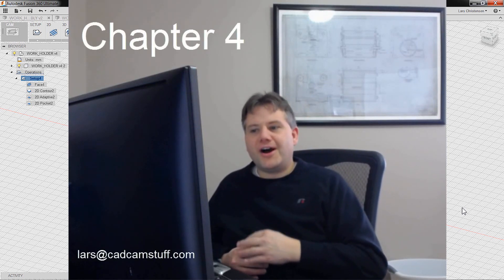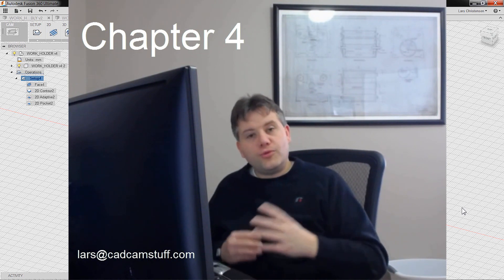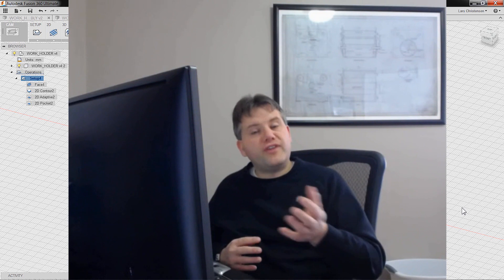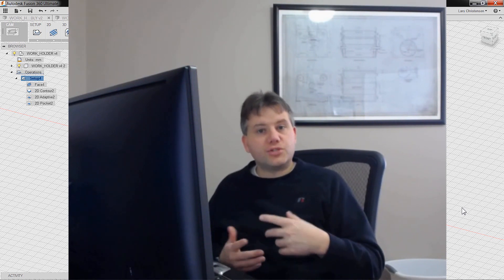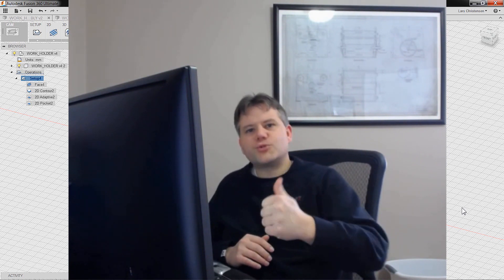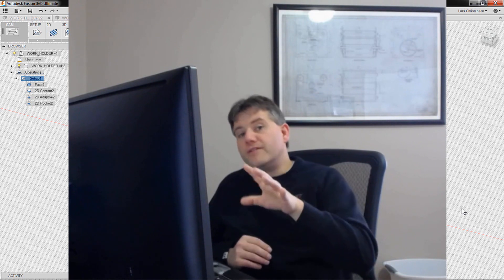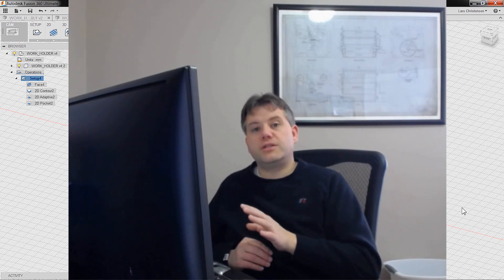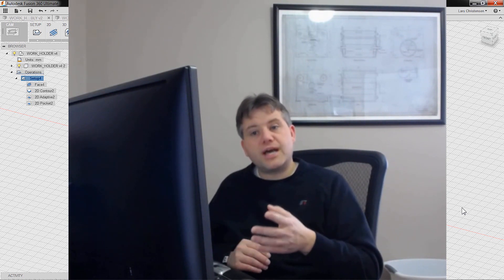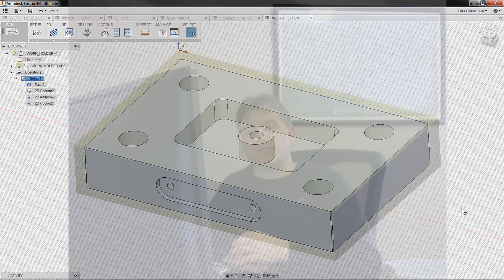Another video on how we proceed with our parts. If you watched the previous ones, you've seen how we took this raw piece of material, picked it up, faced it off, machined around, and showed a couple of tricks regarding cutters and tools. We applied some milling toolpaths to this, roughed out a pocket, and finished the pocket. Now we're ready to start drilling some different holes.